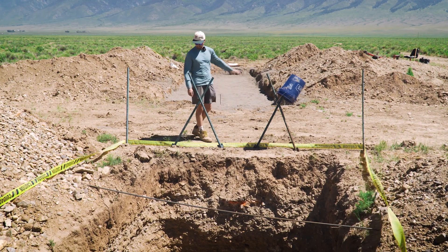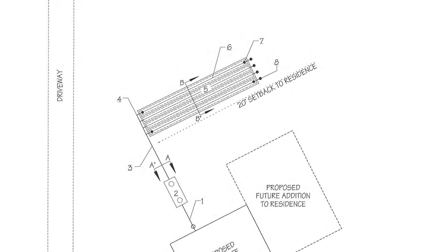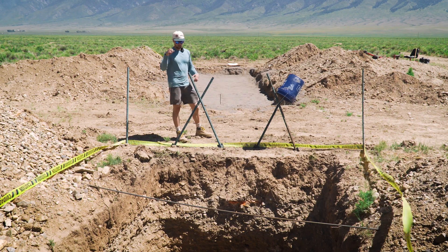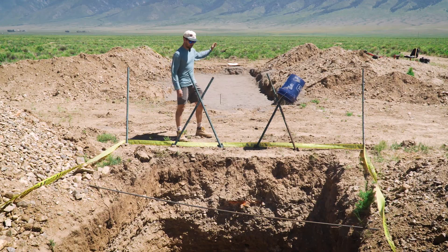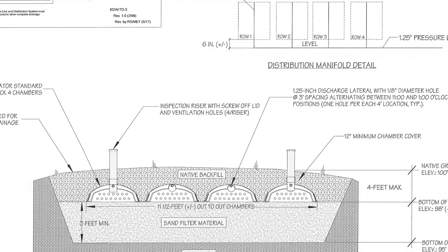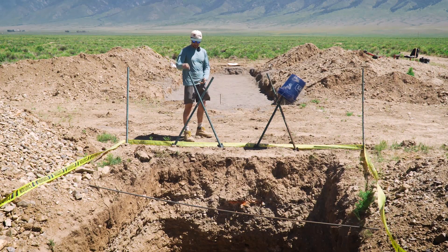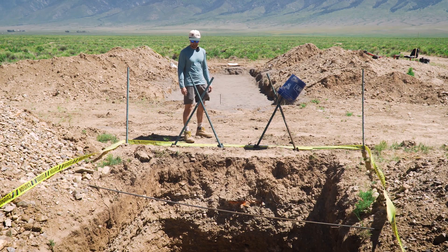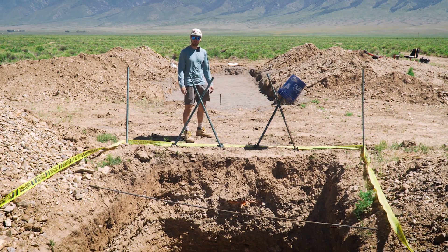Four runs of 48 feet - they're going to need some holes drilled in them to spray out the water. When they drop off the tank, they're also going to be dropping off the infiltrators, and we can get those laid out and get the pipes suspended. First thing's going to be getting this hole prepped, because that's the most imminent thing that's due, and we'll go from there.